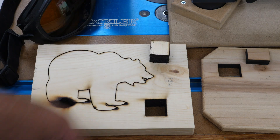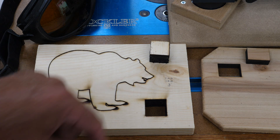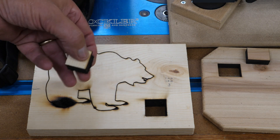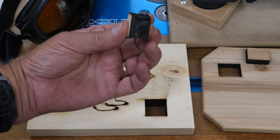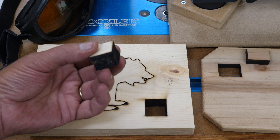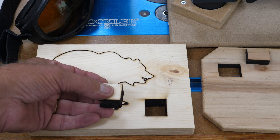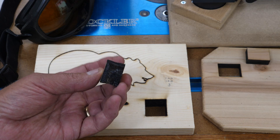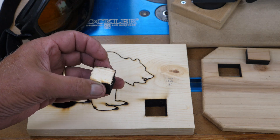Here is a piece I cut out as a square. The setting for that is 100 millimeters per minute, 100% power, and 3 passes — it does make a cut. However, if the pieces you are cutting out have detail, you're going to start a fire. And if you are going after the pieces that are cut out, they're going to look quite scorched. One way to get around that is maybe after your first pass, stop the laser and lower the focus down a little bit — that would probably eliminate some of that concave shape you get there. You do get a lot of scorching on the back even with air assist.